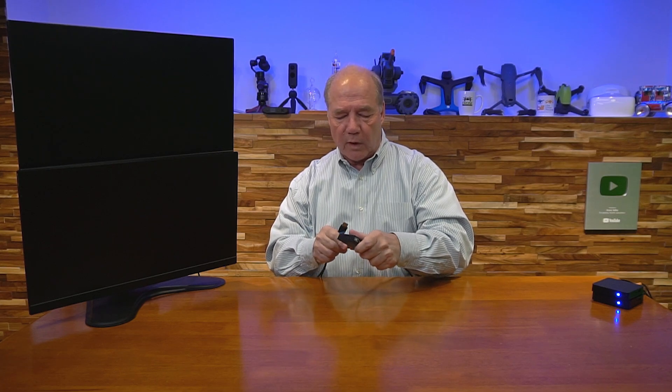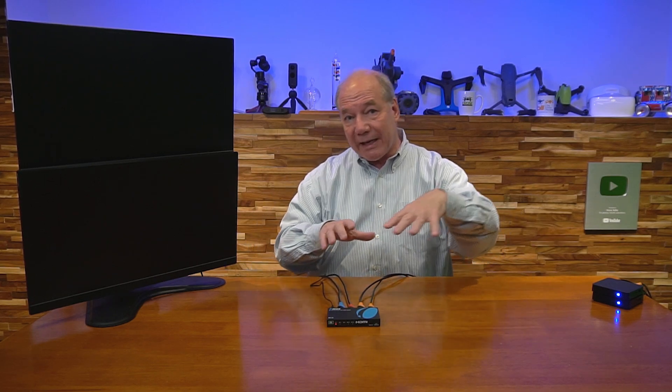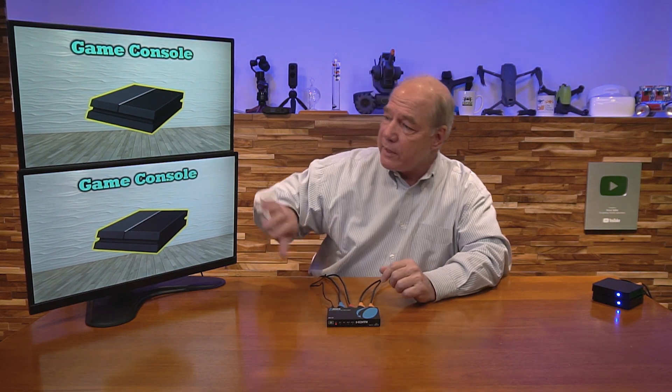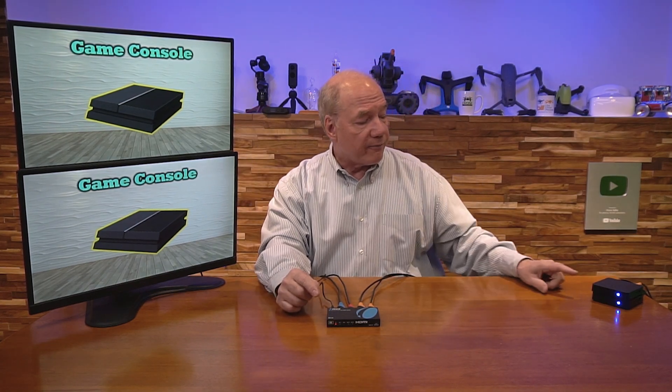Now I'll connect up the output devices — I've got two HDMI cables connected and I'll plug these into Output 1 and Output 2. The power supply is already plugged in with the barrel connection going into the back of the unit. The moment I add power, it immediately starts an internal power-on self-test, checking all the electronics and the resolution of the input devices against the output devices, making whatever adjustments are needed for the best possible picture. You can see dual outputs from a single input showing the game console, and if I want to switch to the media player I just tap the button on the front and it switches both outputs.